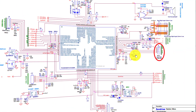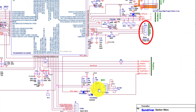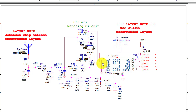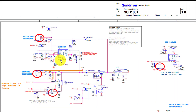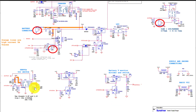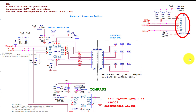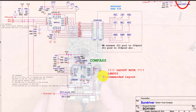The schematic is super complex. There is a microcontroller, a light sensor, real-time clock, buzzer, transceiver for the remote controller, battery charger, current monitor, an LED driver for the lantern, a smart switch for the servo, a touch sensor for the keyboard, compass and accelerometer, and an LCD display.